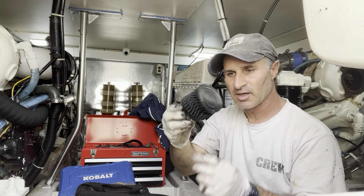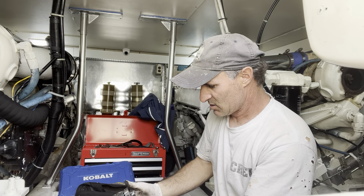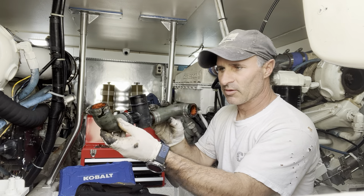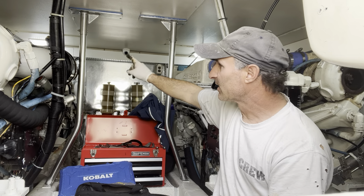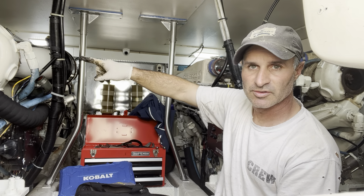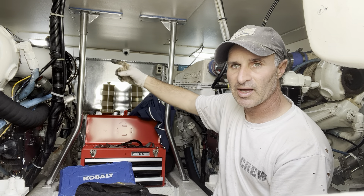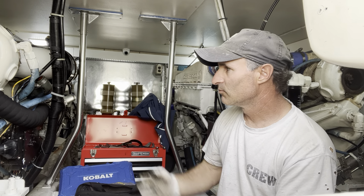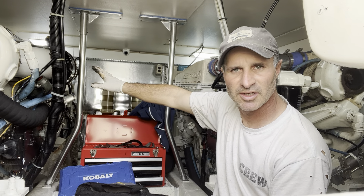The vacuum filter is completely clogged — can't see through it. I just took off the vacuum hose and it's just draining oil everywhere. The filter sits on top here, and that leads back into the intake on the pressure side going into the turbo. So you've got oil running through the top of that, coming back through into your turbo, and then feeding into your cooler — which goes to the top of the engine. It's fine to lube the top of the engine, but not like this.